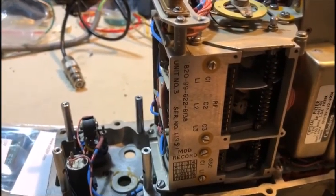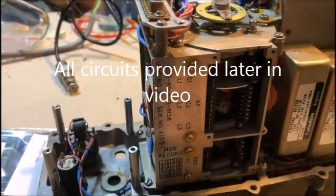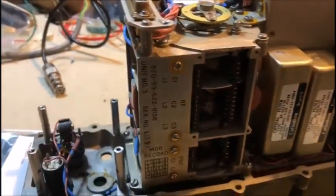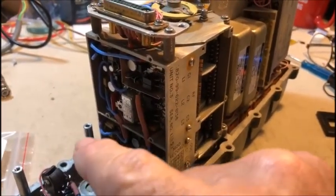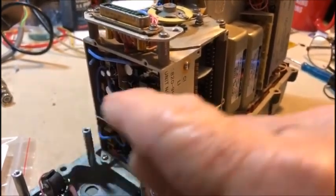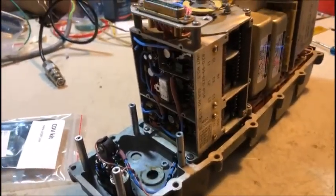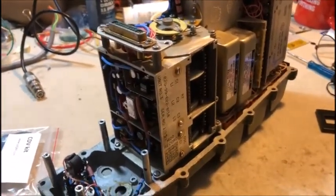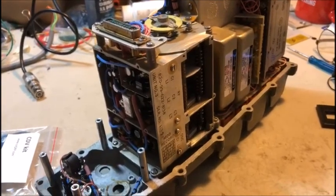There's only a very limited amount of basic circuitry accompanying the little board. Wires will go from that to the display and from there to the two holes with the potentiometer and the encoder, and a couple of buttons underneath. From the VFO section, a cable will go to the 3A board and another cable will go down to the 6 board — I'll probably use the existing cable going down to the 6 board already. A variable frequency oscillator output goes across there, joined onto the board.